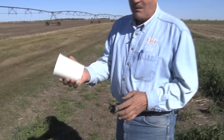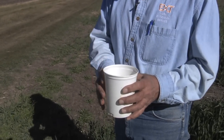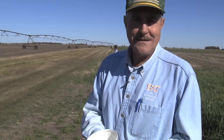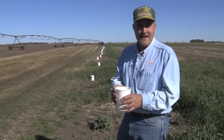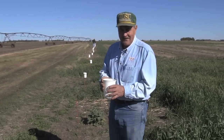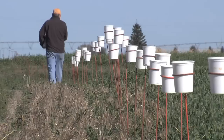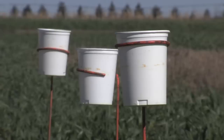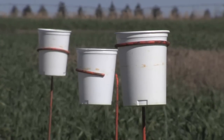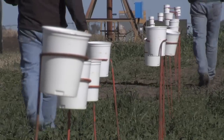The can we use is really just a plastic can — it's almost 4½ inches in diameter. In the old days they would have used an oil can or something of that order. We want it large enough in diameter so it makes sure that what it catches is representative of the amount of water being applied to that area. We just set the can in so that the top is level. We have a little bit of wind today — about 5 miles an hour — but I don't think that will disturb the results too much.